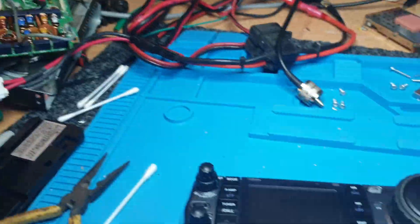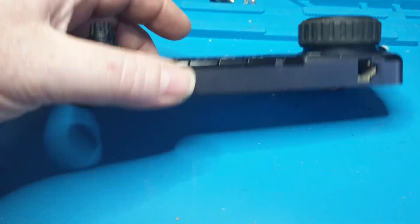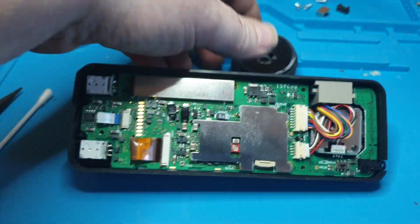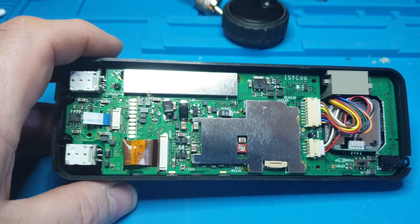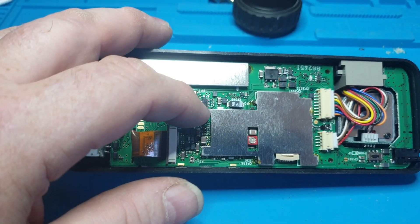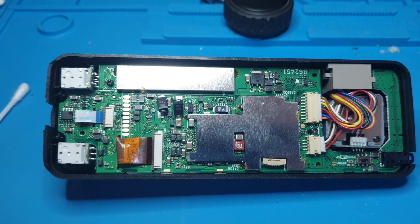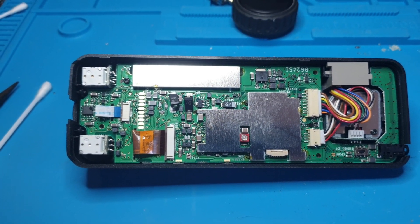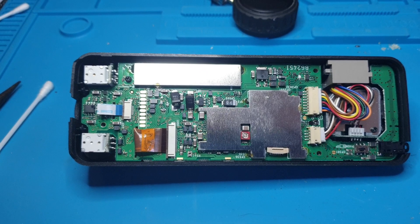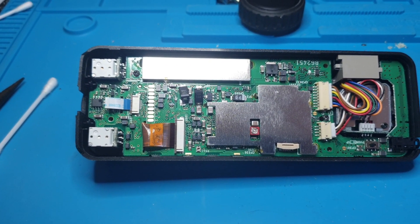We've been over all the outputs and there are no shorts — everything looks great there. The display is fine; there's this knob that keeps falling off, and something on the front display to sort out — whether it's a regulator or not, I need to check the circuit. The good news is the IC7000 service manual is really good for following voltages board to board.